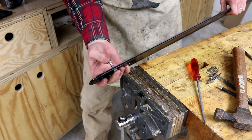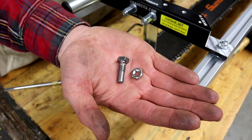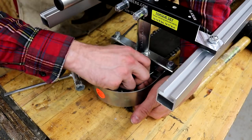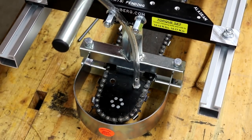The purpose of the oiler kit is to add additional oil into longer bars — it's suggested that you add these kits to bars longer than 36 inches. By having the hole for the oiler bolt overlap the groove, oil seeps into that groove and is pulled down the length of the bar by the chain. This will keep everything moving smoothly, avoiding excess wear to the bar and chain.